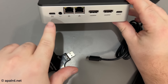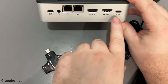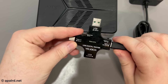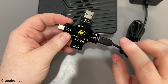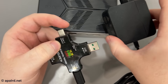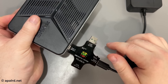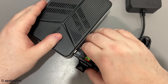Before going further, I want to check which Type-C ports can accept power, what voltages, and what power delivery profiles they support. The port marked 'power' and the one just marked 'Type-C' both use Type-C connectors. Plugging the included power brick into the USB tester reads 19.37 volts — that would significantly damage most USB Type-C equipment unless it's designed for 19 volts. Plugging into the port labeled power, it draws 13 watts and powers on.